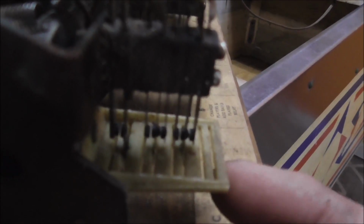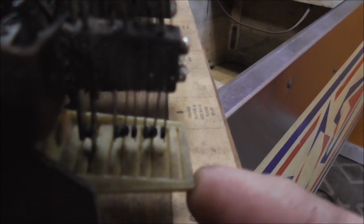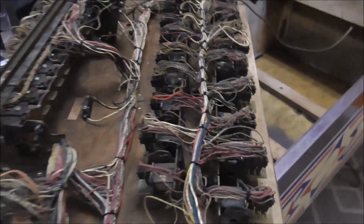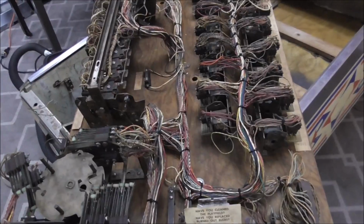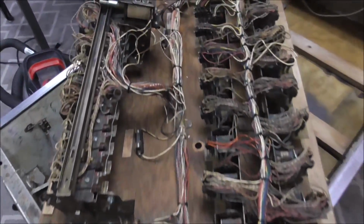You know, it would be really easy. So see this relay here? I'm going to push it in from this, which isn't really the best way to do it, but it would be really easy. See how that top switch is a make or break? If that gets bent just slightly, that's not going to work right anymore, you know? So it would be real easy to get them out of whack just from pushing a piece of, like, the manual up inside of it or something. But yeah, I think it cleaned up pretty good.